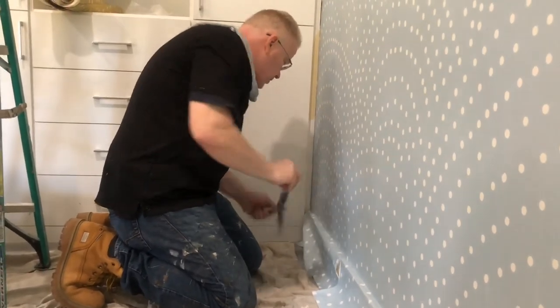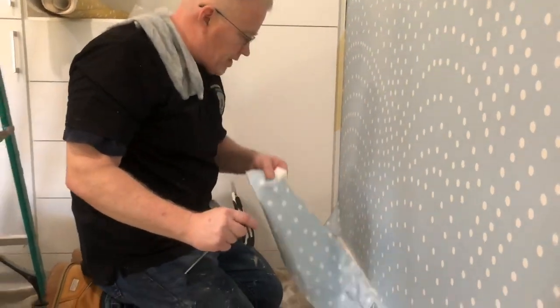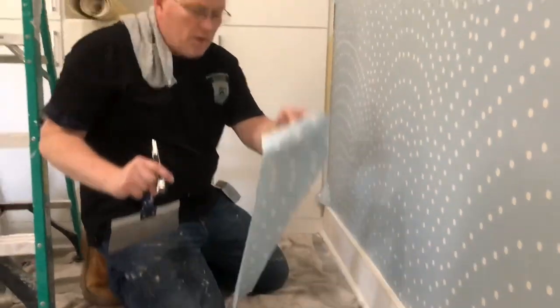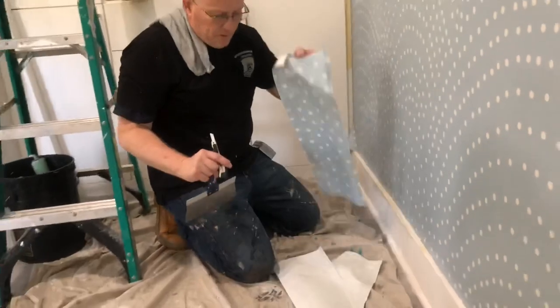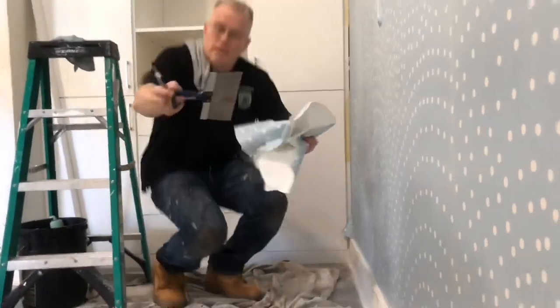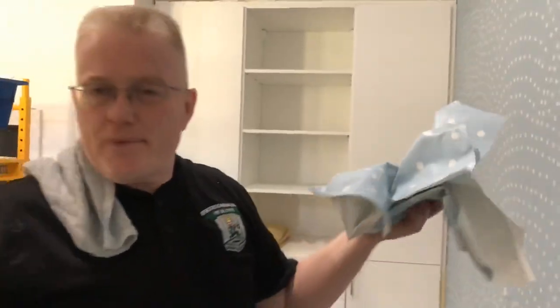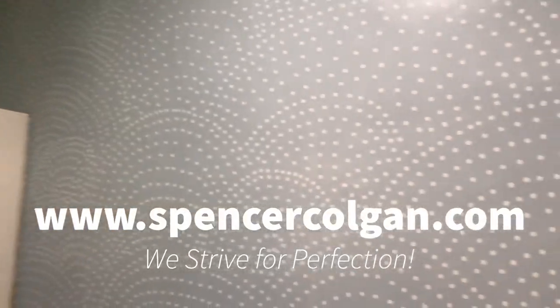When you're finishing up and excited to be almost done, don't fail to cut all the way through — or you'll tear it. Careful, nice and easy. Don't rush anything when you're hanging wallpaper — leave that to the painters. And that, with the exception of the top part, is how you install an accent wall with peel and stick or peel and stick-like material. If you like the video, please click like, subscribe to our channel, and let us know what you think. Thanks for watching — Spencer Colgan is Wallpaper — stay tuned for more on our peel and stick series.